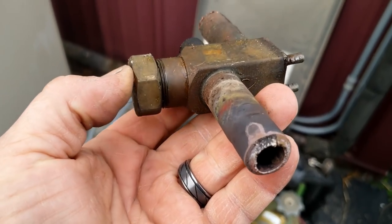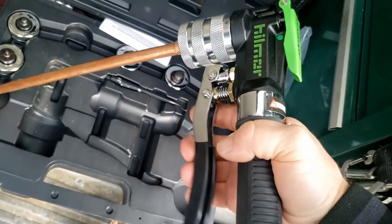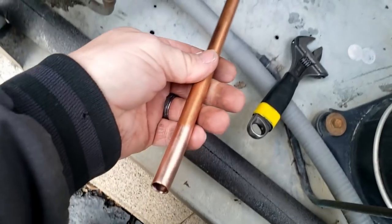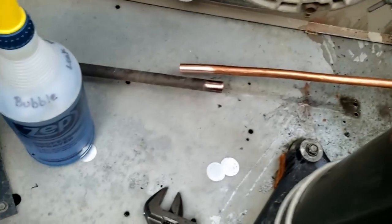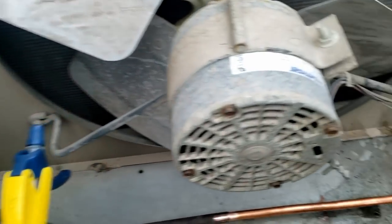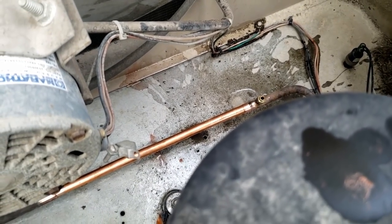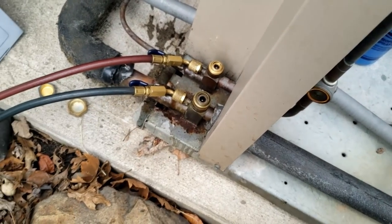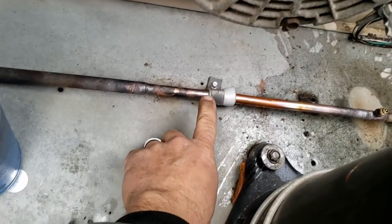You can see where it broke off, then we cut it right there, and that ended up not being threaded on the bottom. Got everything cleaned up for easier brazing. I'll get that fitting over the top and leave it in there. This works out well — I'm able to purge right backwards through all the valves and it's venting out. As soon as I get any remaining non-condensables and oxygen out of there, we'll start brazing. The solenoid's closed on the other side.